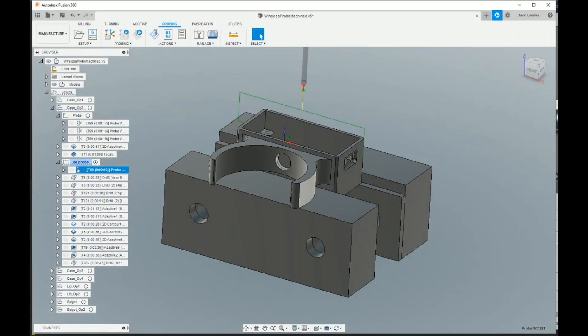With the accurate re-probing of the X-axis complete, it's now time to go ahead and finish the machining. I hope what you'll have got out of this is that the probing routines in Fusion are incredibly easy to use, and you can do probing sequences which, yes, you could have done by hand, but when you do them in Fusion it's as quick to set up and it will run over and over again - it will never make a mistake, it won't jog the wrong axis, it won't jog the axis in the wrong direction, it won't jog it at the wrong speed. The number of probe tips that get broken is so much less doing it this way. I hope you enjoyed it and thanks very much for watching, bye!